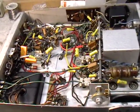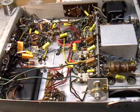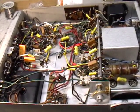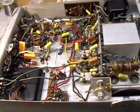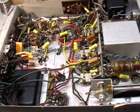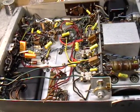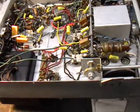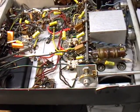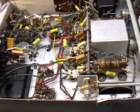As you can see by all the new yellow caps, this chassis has had a complete recap, with the exception of the two filter caps, which are the originals. They were tested and found to be in perfect condition — no leaks at all, no shorts. The only other components that needed replacing were these two orange capacitors. They are line filter caps and were replaced with safety caps, so that if there ever should be a short, there won't be a fire under the set. This resistor was replaced because the original looked like it had been overheated at one point, and this other resistor was out of tolerance.